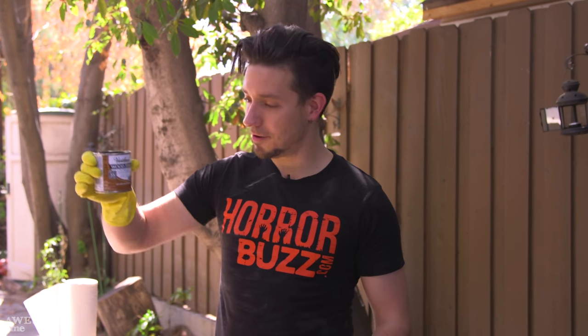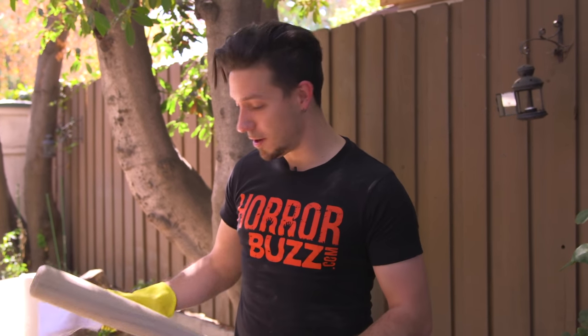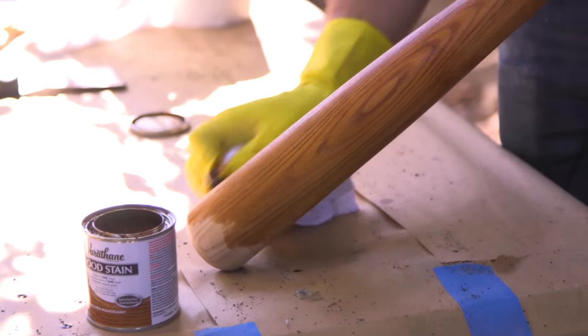The bat's back down to natural wood. I've got a little bottle of golden mahogany stain that we're going to apply with a rag. You don't have to get fancy with this — you can even use an old t-shirt to put on stain. And actually, between stripping off the varnish and re-staining, you now know how to refinish furniture. We're going to put one coat on, see how it looks, maybe it needs two, and we'll take it from there.